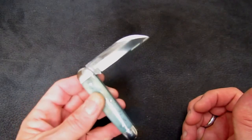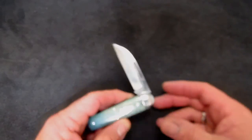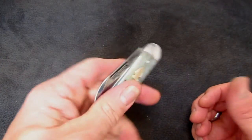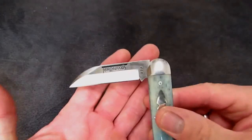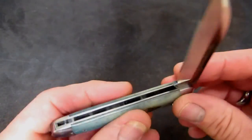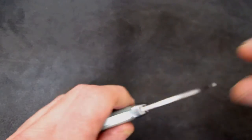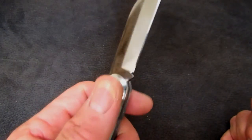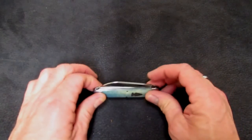Perfect walk and talk. Mike Latham at collectorknives.net just loves to see a half-stop knife that gives you that sort of roadrunner stop — that lets you know the spring is strong, but it's free enough to let the blade move. So I love my Fremont Jack; I've loved it since I got it. One little problem: I think it's because of the choice Derek made to leave that heat treat scale — the surface of the steel where it contacts the liners as it moves through its range, folding and unfolding. Because that scale is very, very soft, I believe it wears away, and there is a noticeable amount of side-to-side play. It's been present in this knife since it was a couple weeks old, and it hasn't really gotten any worse, so I'm not going to worry about it. So that was my first warning — the Fremont Jack.